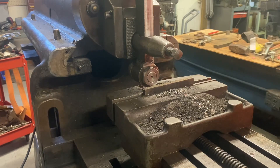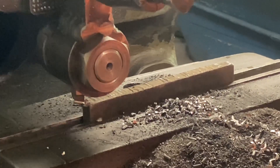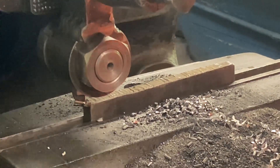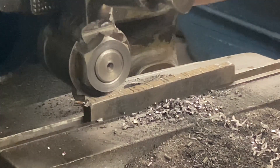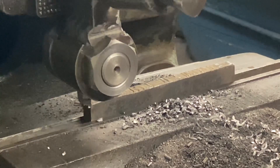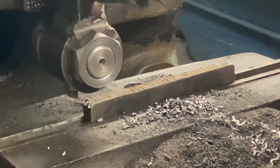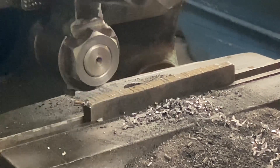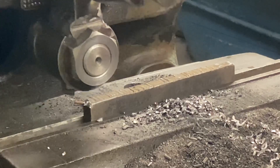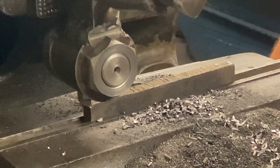Let me get it set up, we'll get it cut. Let me zoom you in a wee bit and you can watch it go back and forth — see how we do, get it fired up. Bringing the head down; the surface is so rough. Let's do a quick little cleaning pass. Okay, engaging the power feed — we're going to do about a 25 thou step over.